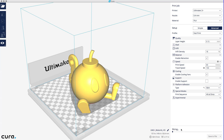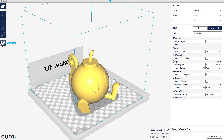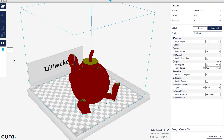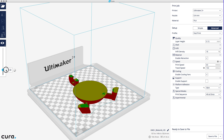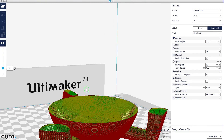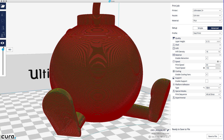Now it's preparing to slice. All right, it's done slicing. Let's go to View Mode — Layers. It's processing the layers now. Once those are done, we'll be able to move this slider and see the different layers. Looks like Cura's done. Let's bring this down a little bit and we can see how the layers are made. There's our infill. Red is the outside of the model, and then as we go up, there it is. Now we need to save this to the SD card and send it to the printer.